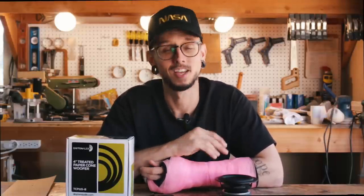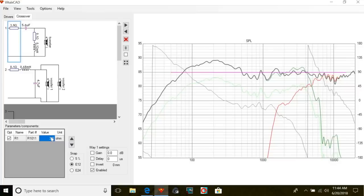This isn't a large woofer. With a three and three quarter inch cone and a five and a half inch overall diameter, this woofer won't be shaking down any walls. It's more like a mid-bass, but running it through Win ISD gives us a pretty good plot down to around 50 hertz at negative 3 dB in the right vented enclosure — pretty deep for its size. That makes this a great driver for a small two-way setup, and you can get away with a pretty simple second order crossover to filter it.